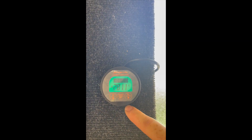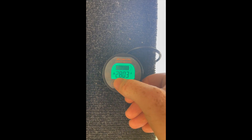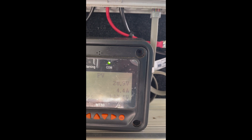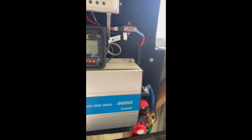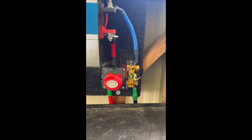The readout from that shunt tells me the battery's 99% full, we're at 26.8 volts, and there's 2.8 amps going into the battery. We're actually pulling 4.4 amps off the panel, which means some is going to this and to the fan. The fan's pulling 34 watts, and the inverter loses about 20 watts converting from DC to AC. So that's the shunt — a nice-to-have, not mandatory. That's a cheap shunt power meter.